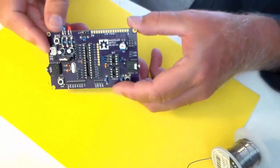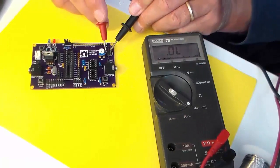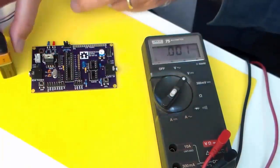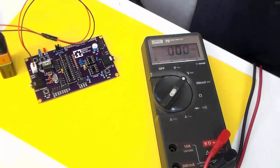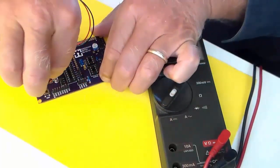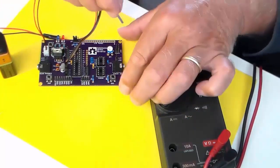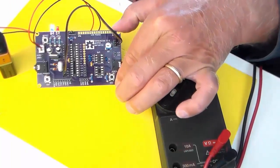Before we install the ICs, let's make sure that 5 volts and ground isn't shorted out. No beep — we're good to go! Now I'll hook up a 9-volt battery and we'll check the voltage coming off of our regulator. 4.92 volts — that's 5 volts if I ever saw it. We'll add a little jumper to D8 and D5 and ground them. The red LED will light — there it goes, it's on. And now the blue one — yes, okay, that's good too.